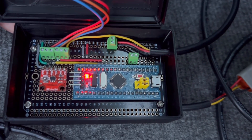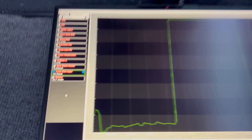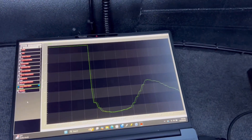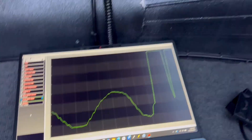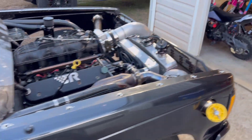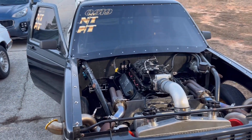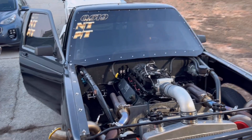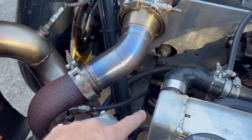There is the time-of-flight sensor. It is a blue pill microcontroller and a digital-to-analog converter, and then I 3D printed this box so it can be mounted up on the truck and zip-tied on. As you can see, I have it set up to read 0 to 40 inches, so as I move it up and down it is reading. It's also set up for 0 to 5 volts. I'll probably zip tie it to the bottom of the frame there.